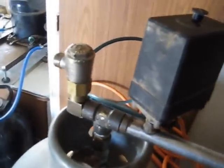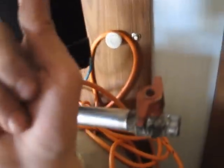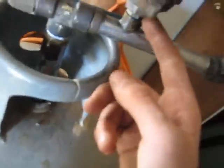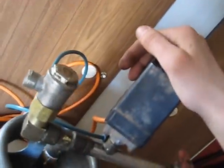So now all I've got to do is hook the compressors up, test the electrical side, find out what it cuts in at, and adjust that. Basically, pressure gets in here and pushes up so the contactors pop — clicks. I think one setting is cut-in and the other is cut-out, so when the pressure builds up it pops and shuts off. The contactors are open, and the cut-in must trigger when the pressure drops too low — a little level that presses down, closes the contactors, works electrically.